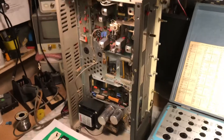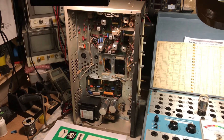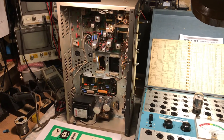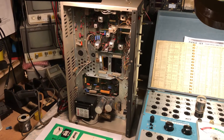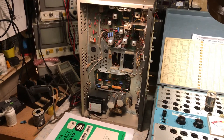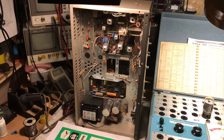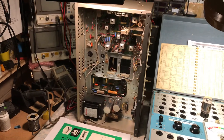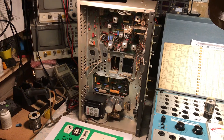This particular radio was purchased off of eBay. I will be making another couple of video clips, probably in separate parts of the entire restoration. This is going to be probably an 80% to 85% ground-up restoration. Right now we're just completing the power resistors, replacing all the power resistors and upgrading them.